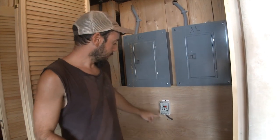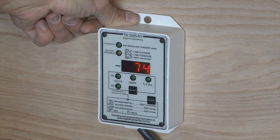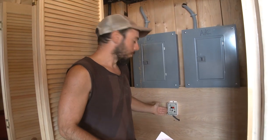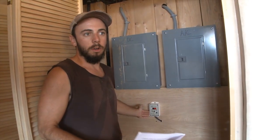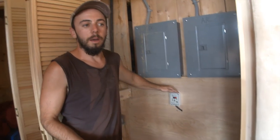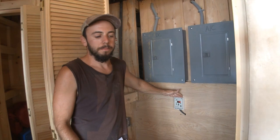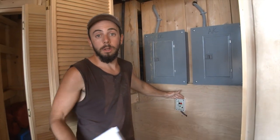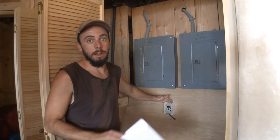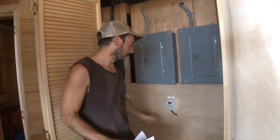What we're looking at right here is a percent full number. Right now I'm at 74%. The reason I'm that low is because we've had three straight days of rain. Normally I'm up close to 100 — I get up to 100 every single day when the sun's out. The percent full is a really nice feature. You don't really want to go below 70% on a regular basis, and if you get down to 50 or 60, you definitely want to stop using electricity to spare your batteries or get a generator to charge them.